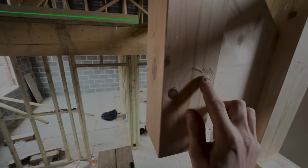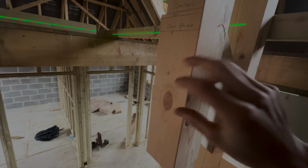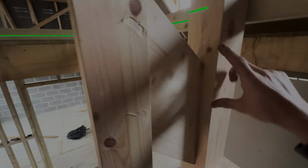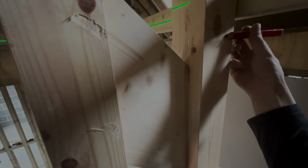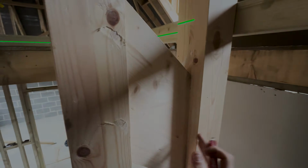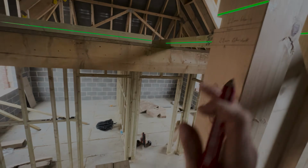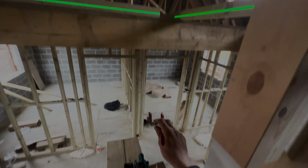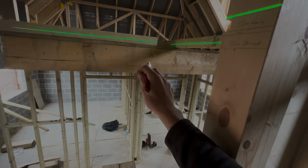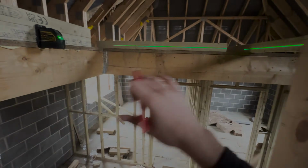Because on this side here, excuse the roughness, but you never see this. We're going to come a 9x2 down here, notch this way, and here, probably, and leave about 30mm left. Alright, so we leave a third in, and that will all get notched out. It will tie into this, tie into here, and then you'll have a hanger, and it will run over here. The other newel comes off of there and comes up, and you've got essentially a double trimmer coming here, picking the weight of this up. And this goes over here to create a landing here.